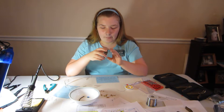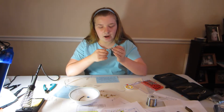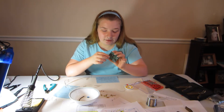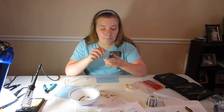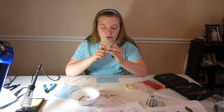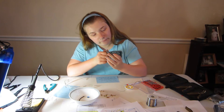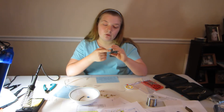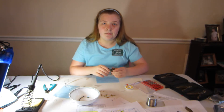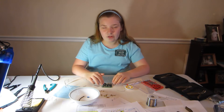The crystals are 14.06 megahertz. After you install them, you need to put in a ground lead — you'll solder it to the crystal case on this side. I've put the value label facing outward for easy reading, but you can put them in either way.